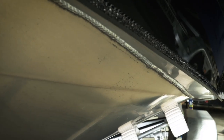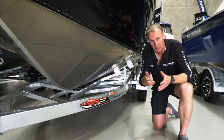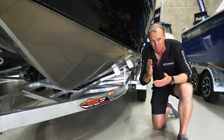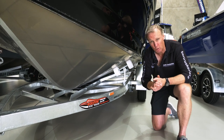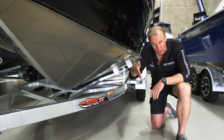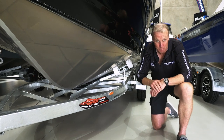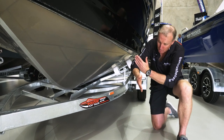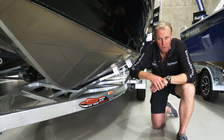You win on all fronts. One thing all Bar Crushers are known for is our rough water handling. When you're offshore in steep swell and waves, you want a boat that planes through chop nicely and gives you a soft ride, but you also want great following sea performance. When a boat's running downhill, you want to make sure the hull is tuned and has enough lift up front so the nose doesn't bury. If the nose buries and the centre of gravity comes forward, the boat will steer on the nose and give you that awful broaching action.